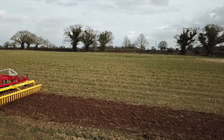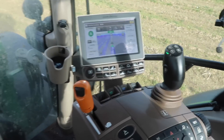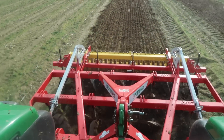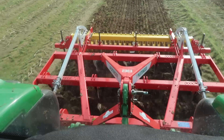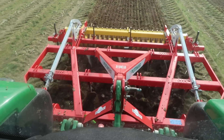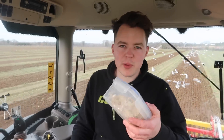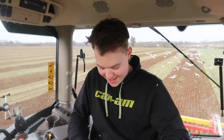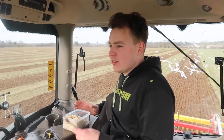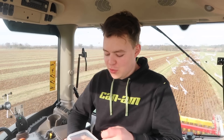So we're all set up and I can just simply put the steering wheel up like that — I'm just going to eat my lunch actually now. Lovely nice job it's doing at the back. I just want to be levelling out the ground; I set the cultivator up yesterday for this ground, had to adjust the top link quite a bit to make the points dig in. GPS farming is just the way to go really, isn't it — you can see what you've got behind you, you don't have to worry about steering. Welcome to the 21st century!